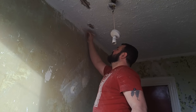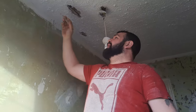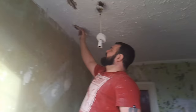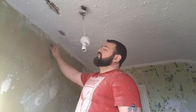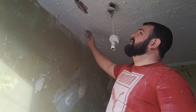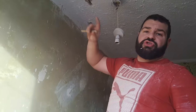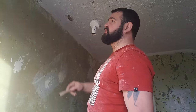If you have a plasterboard ceiling you can just see the joists through the hole. A lot of people just put screws anywhere hoping to catch the little timber lath strips — it's doable but I wouldn't recommend it. We always find the joists and screw straight into them.